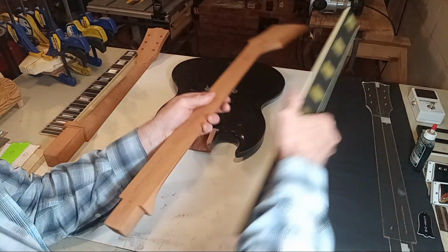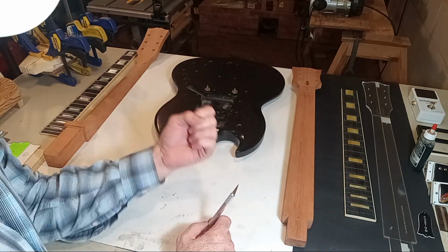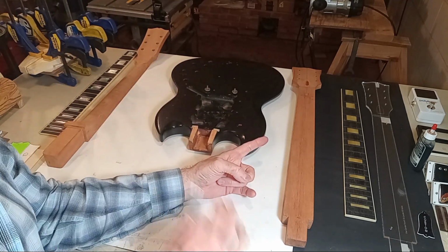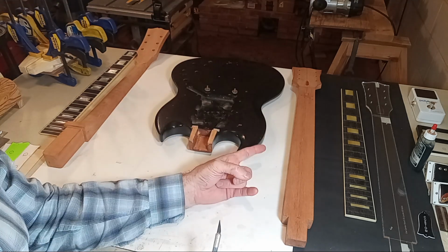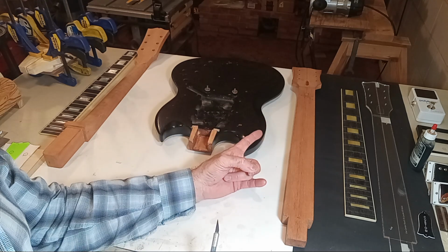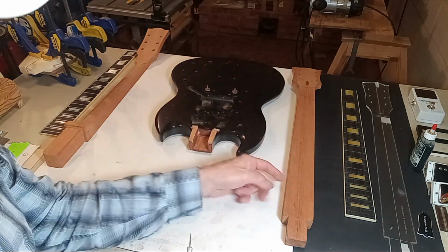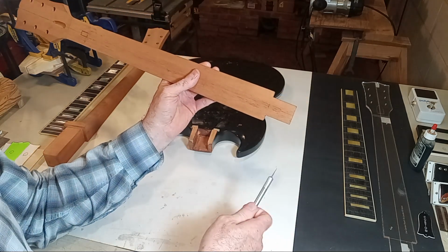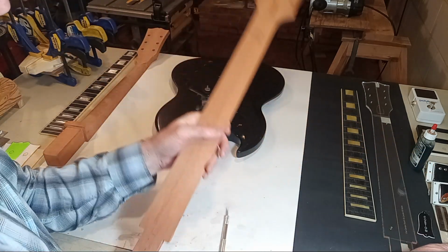So going full circle, as I was trying to finish, I've got the job down to basically 4 different jobs now, if not 5 maybe, not considering the electronics. But the headstock overlay, pretty much close to 100% finished, then glued down. Well, we'll call it operation 1: doing the fretboard, the headstock overlay, then gluing it down, and then based on the 19th fret location, which is a defining point along our speaking length. So as long as we're leaving enough room, and we already know which nut we're going with.